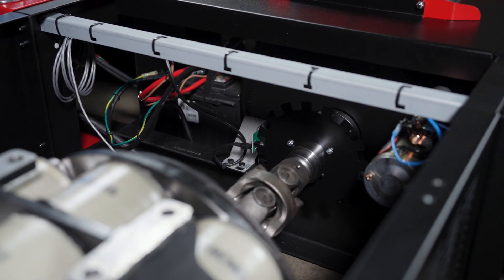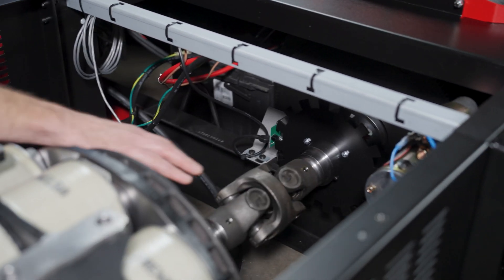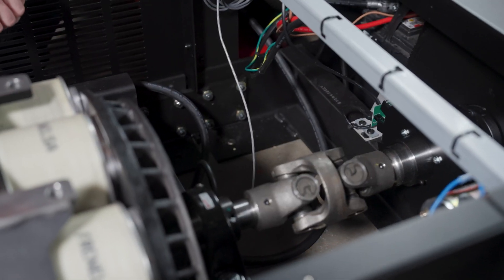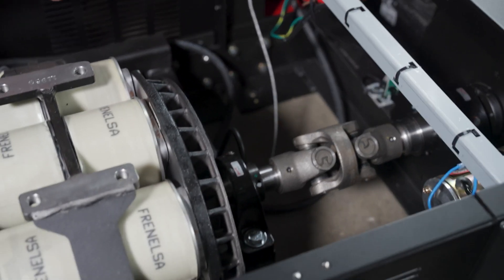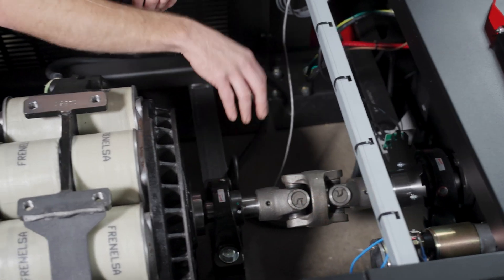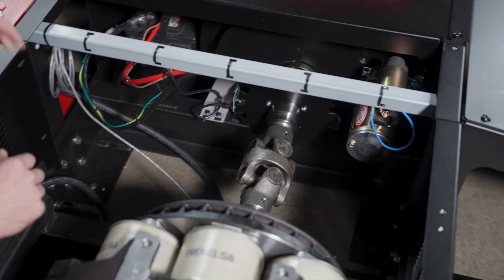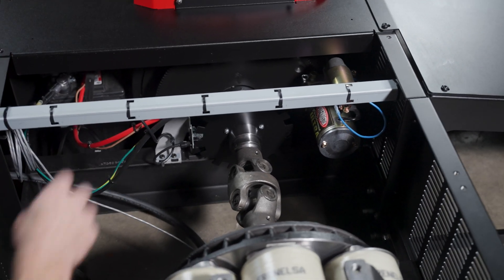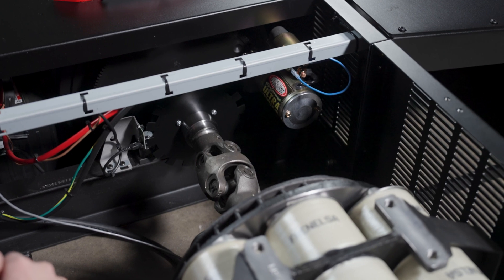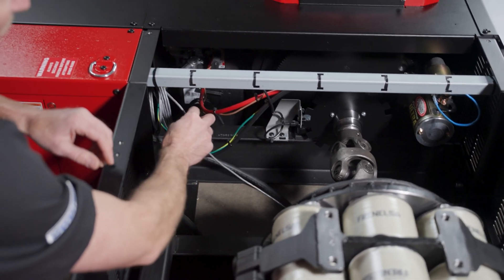For general maintenance in the back: make sure your driveline is in good condition and all bearings stay properly torqued throughout the lifespan of the dyno. If you have a starter and plan to use it, make sure it's in proper alignment and those bolts remain nicely torqued so that each time you hit the button the bendix jumps out into the right spot and engages the dyno drum.